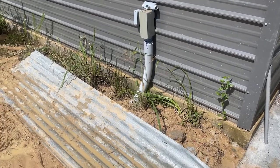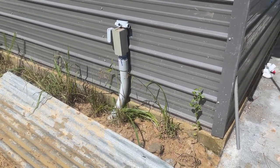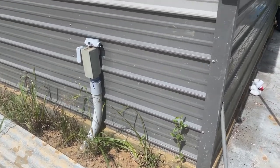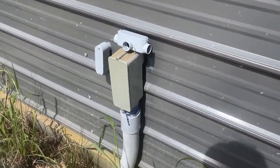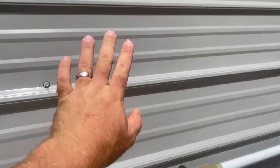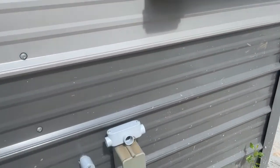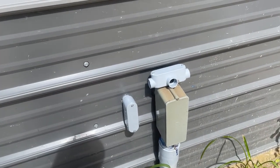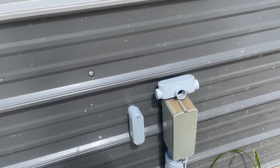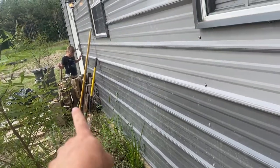We're just working on the electrical for the kiln. This is pretty simple, pretty basic. We're just running a conduit through the shop wall — this big two-and-a-half inch conduit right here is our main power coming into the shop. Our panel is right here. We've got 60 amp going out to the air conditioner. We just ran that with a one inch, and we're actually using a three-quarter now to run a 60 amp for the kiln and a 20 amp for a sewer pump.